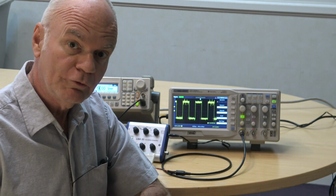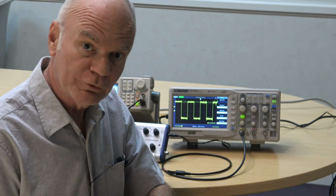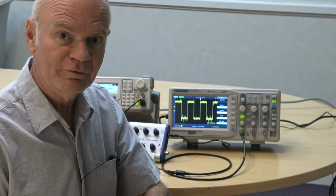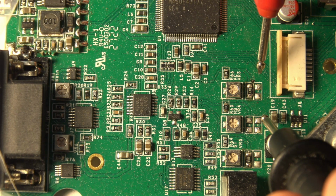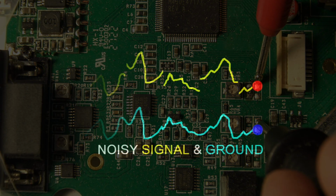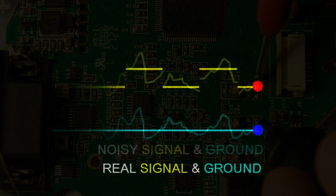If you want to do very small signal electrical measurements, there's usually external noise present that has nothing to do with the actual signal. This noise can be hundreds of times more than the expected noise of the system. Usually, you want to measure the voltage at a certain point with respect to common or ground. Unfortunately, that common or ground is often noisy compared to the ground of the oscilloscope or amplifier or voltmeter that you're using. This is because of ground loops and direct capacitive pickup of external fields.